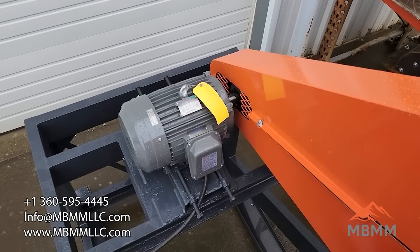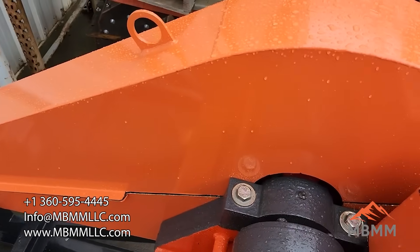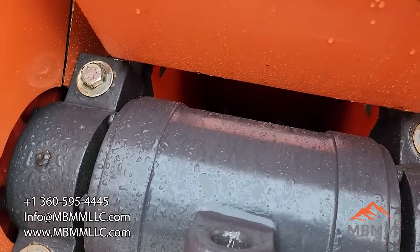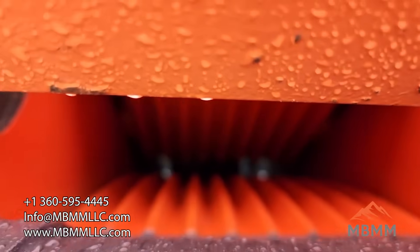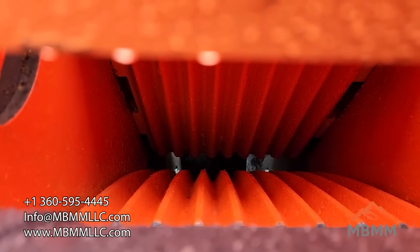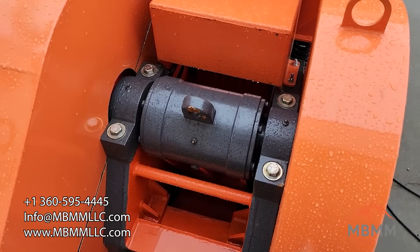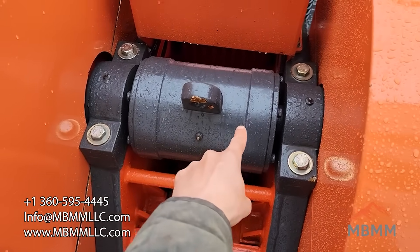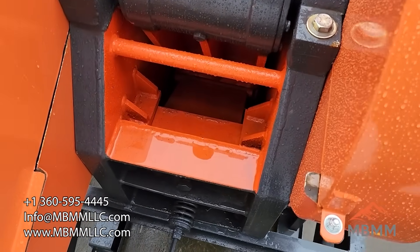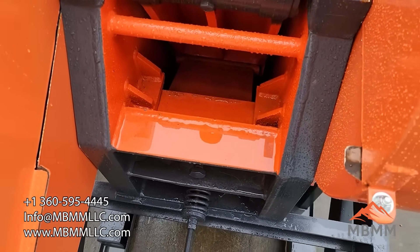Here's a look at the motor — this is a 10 horsepower three phase for the jaw crusher. Belts run up to the flywheel here on the jaw crusher. Now you're looking down at the swing jaw and right down into the jaws of the jaw crusher. Through that little slot is the conveyor where everything drops out and gets fed up to the fine ore bin. The jaw crusher turns about 300 rpm. There are several grease fittings that need to be greased every day, every eight hours of run time. I have some other videos on YouTube about how to adjust the jaws that you can check out, and I'll leave a link to those in the description.